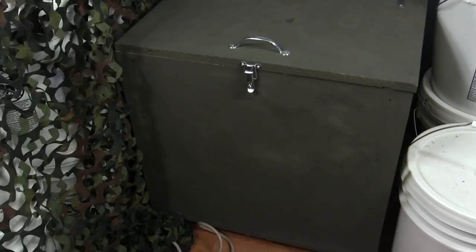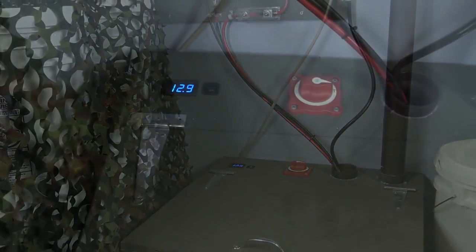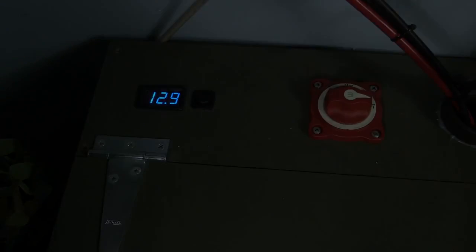So, to recap, when sizing your battery bank, use, as a rule, a minimum of 2 days, but not much more than 5, and get as much capacity up to that 5 days as your budget will allow. Even though my system's sized at only 2.5 times what I consume, I've gone 5 or more overcast days in a row. Now this is partially due to me sizing the generating side at 1.5 times what I need as well. There are many other nuances and details you need to know about batteries, and we'll cover everything you need to know, both about the batteries, the box, and everything in it, on it, and tied to it in a future part of the series.